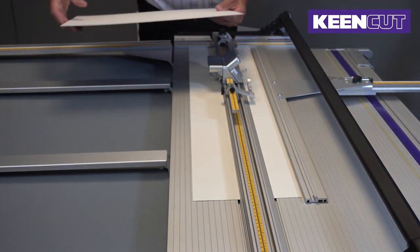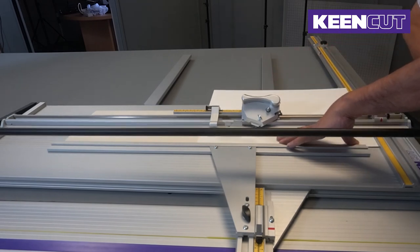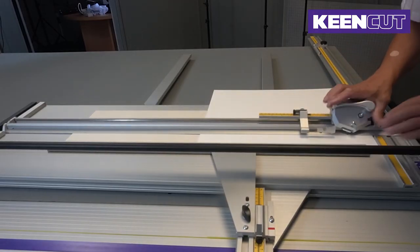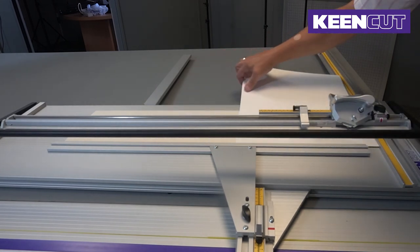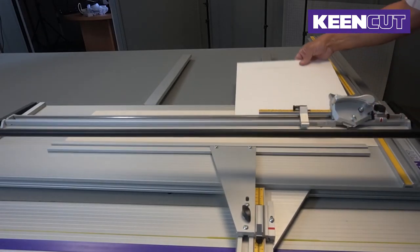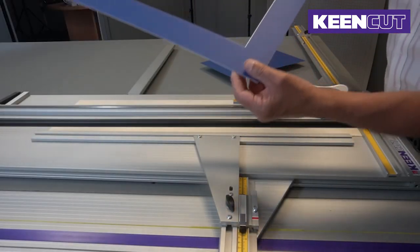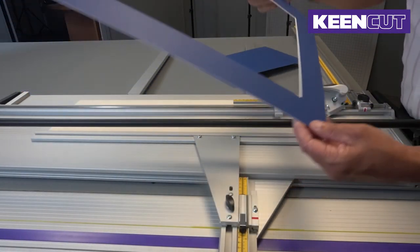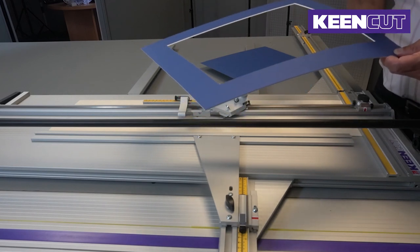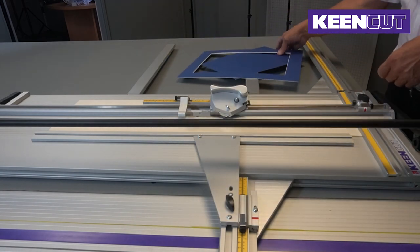So there are our first two cuts. Third cut — remember that this is going to be the corner where our two new cuts meet. This corner here, we have undercuts which we know about. But this corner here — that is a perfect corner. So all the corners, irrespective of what settings you make now, each corner will be as accurate as that. That's the calibration procedure. That's also how you cut a straightforward mount.